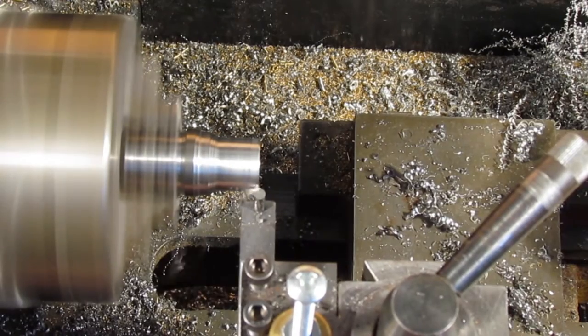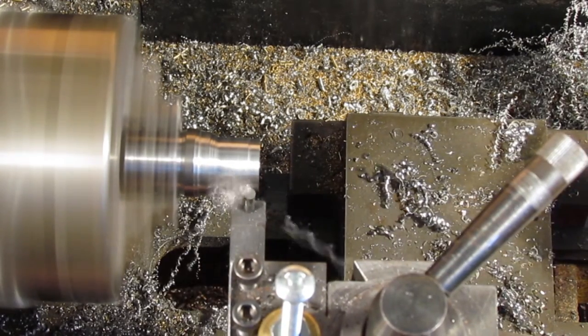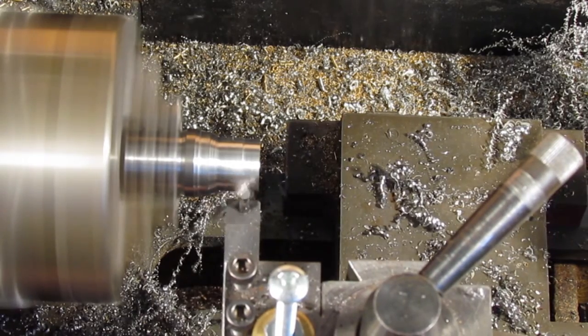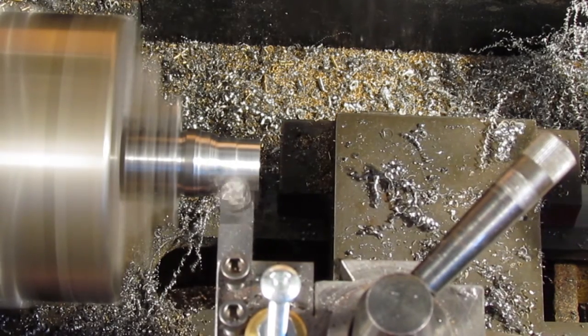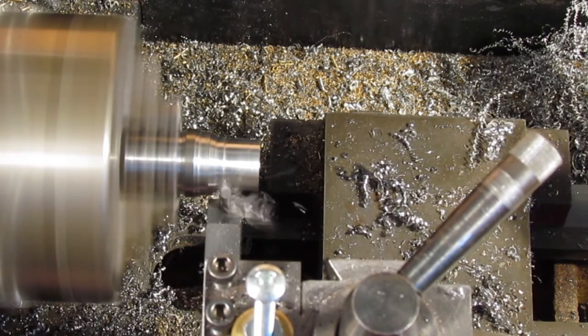This is the 1/8 carbide round bit, taking about a 1/10th depth of cut. RPM is 2500 and machining a piece of cold roll steel. I purposely fed the bit into the radius forming in the middle to see if the tool would chatter, but it machined very nicely.